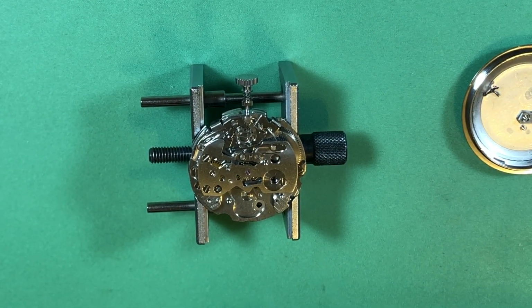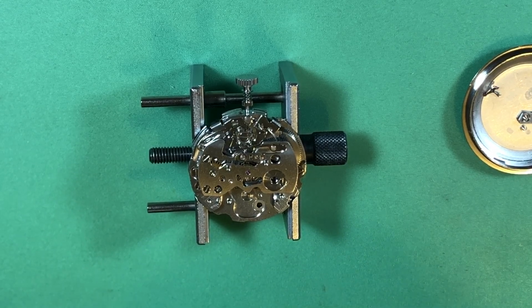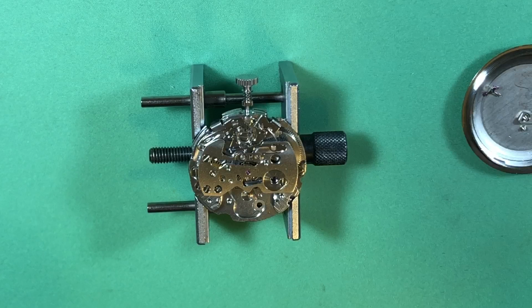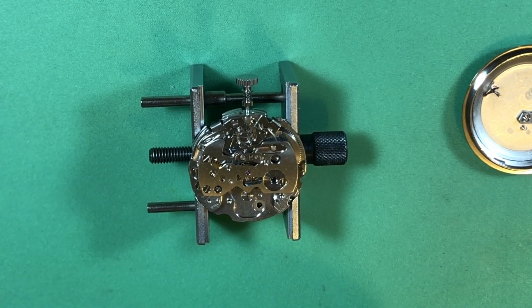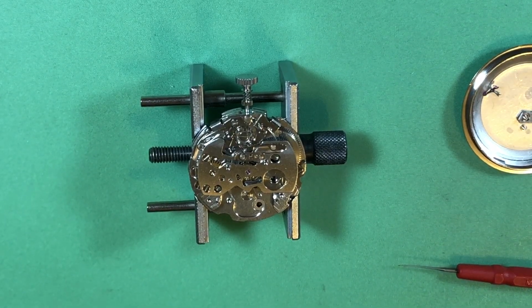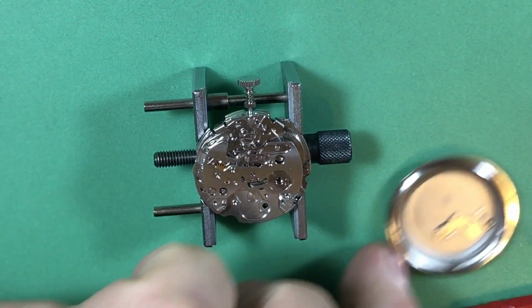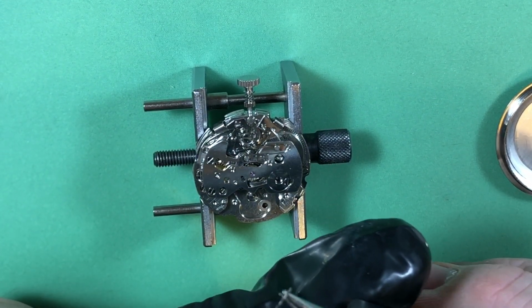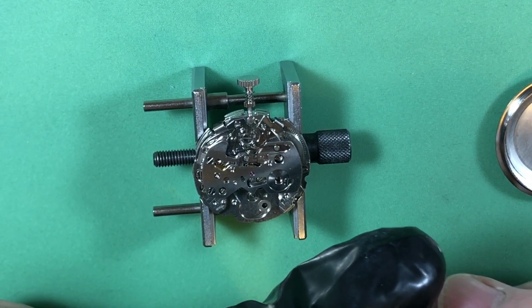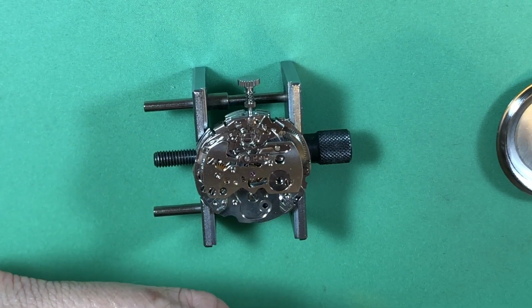Satisfaction. So now, unlike the last time I did one of these, I'm going to be extraordinarily careful, even more than normal, when I'm putting my 9415 on my pallet stones. Gotta be careful. Believe it or not, all the 9415 I need is on the tip of that oiler right there. I don't need any more than that. Yeah, those faces look nice. Good. Entry stone.